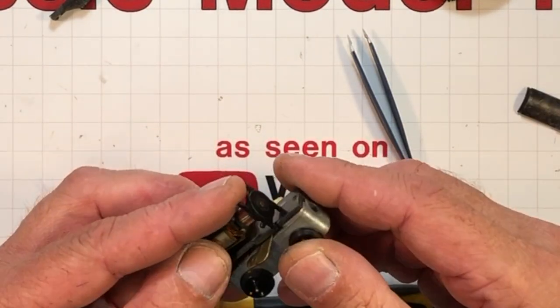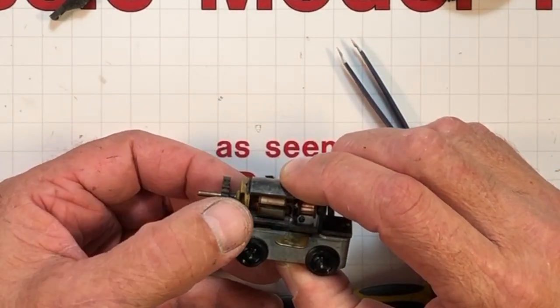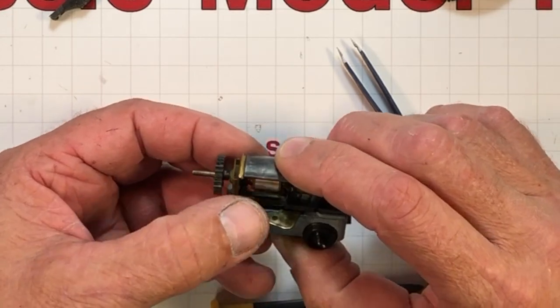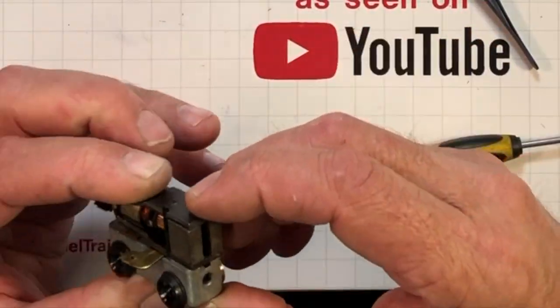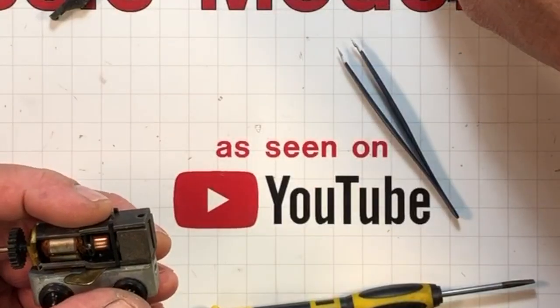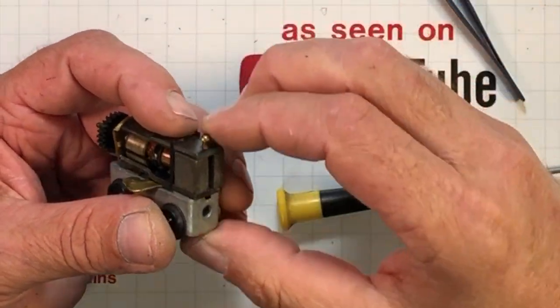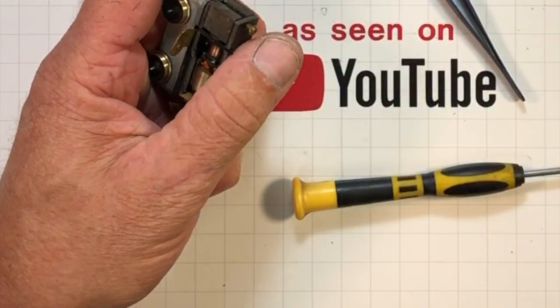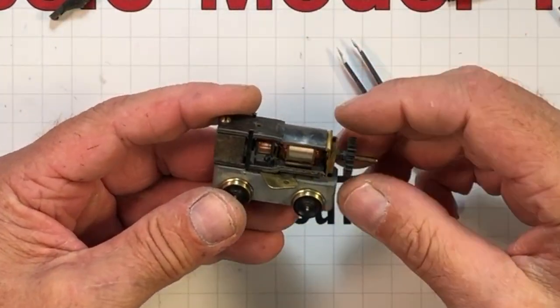I'm going to put the short ones down, armature shaft in, slide the top plate in, and then roll this front one together. Our magnet has a U-shape where the bolt goes through — put that down like this, get our fine little brass screw, put it in, and this is what's going to hold our motor assembly completely together. Tighten this up. Now our motor's all put together.